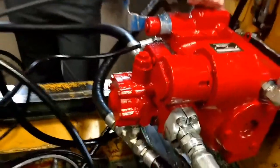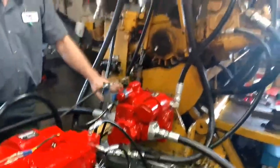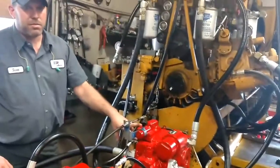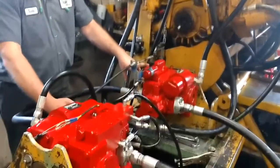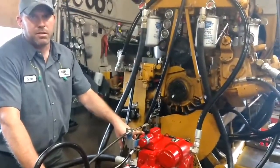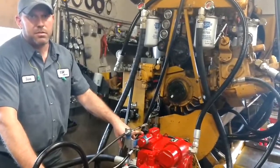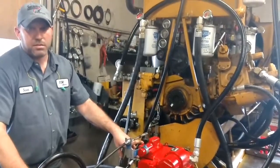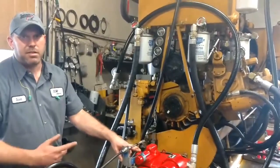Charge pressure should be around 250 PSI in neutral at the pump. When you check it in stroke, you will be switching gauges and running off the motor, and it will be between 210 and 220 PSI — which should be 30 to 40 pounds less than neutral. This creates oil flow between the two housings and back to the tank to cool.